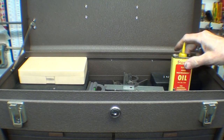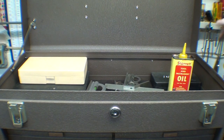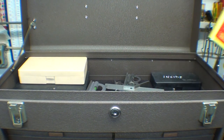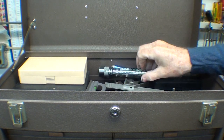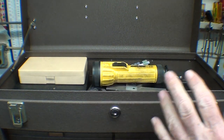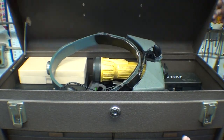You're going to need some oil, but I do not really recommend keeping it in the box. Sooner or later they fall over, make a mess, and all the felt gets soaked. Liquids — unless they're sealed — need to stay on the bench. That goes for Loctite, cutting fluids, all of that stuff. You need flashlights — I like these little pen lights; I particularly like this one because it's so bright. You need a magnifier too — that is one of my major tools, and I always put it in the top so when I open the box that's the first thing I see.